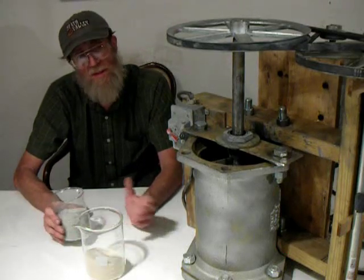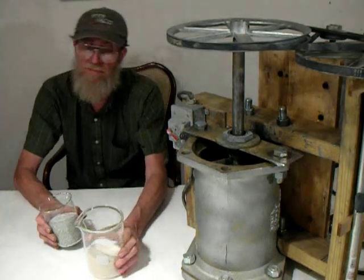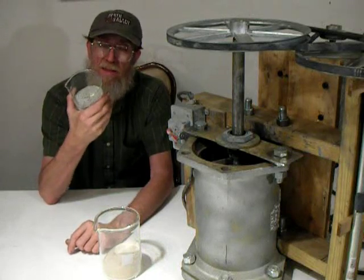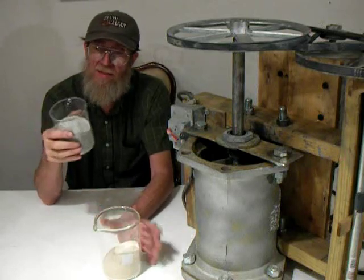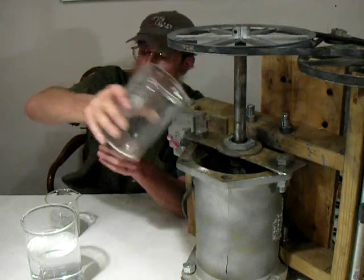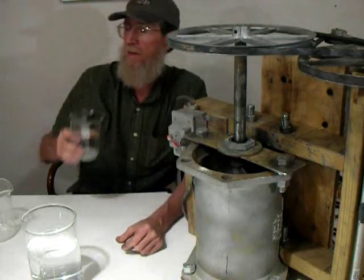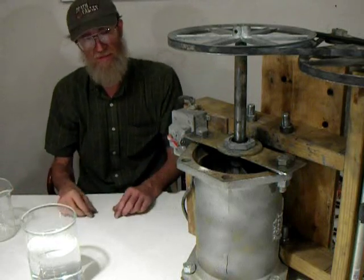Today what I would like to do is explore the possibilities of this working as a sand muller. What I have here is a basic white clay sand, and this here is Bentonite clay — it's actually sold as a clay-type kitty litter, you can pick it up at pretty much any large pet supply store. So we'll mix this in. We'll add two of these and about half — we're just going to play this by ear. As we need to, we'll adjust it with sand, clay, water, and all of that.